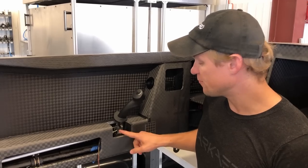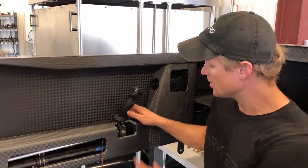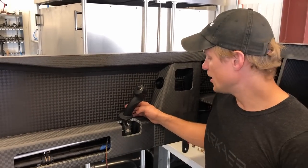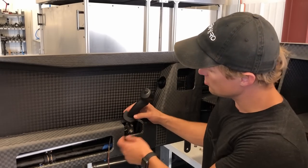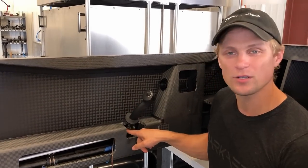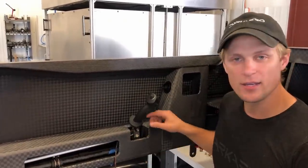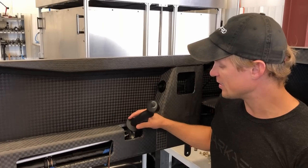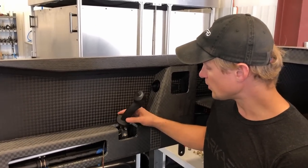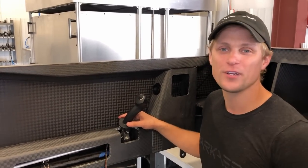The next step will be to make the final version of this. I'm happy with this concept. I'm going to have these CNC cut out now and make the pilot and copilot side, then install those. I also need to install some spacers in here — you can see there's a little motion, so those spacers will limit the left and right travel. There's also a small cutout I need to make to increase clearance at the far inboard segment of travel. After that, we'll be able to install the grips on both sides and have a full-fledged control system.